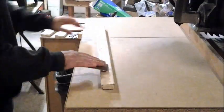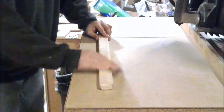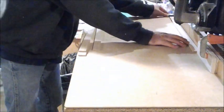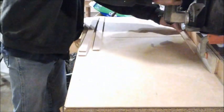Back over to my radial arm saw / sanding station to give the scabbard a light sanding to remove any router marks. I set up a stop block on my radial arm saw fence so I can cut 8 pieces 8 3/4 inches out of some oak strips.